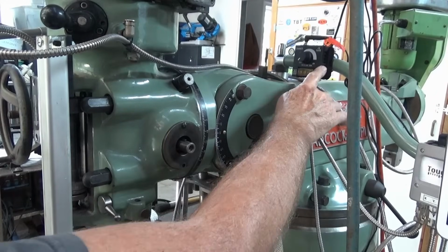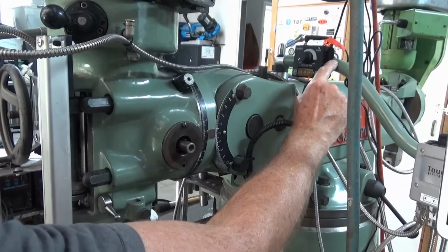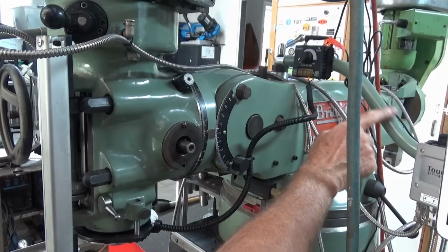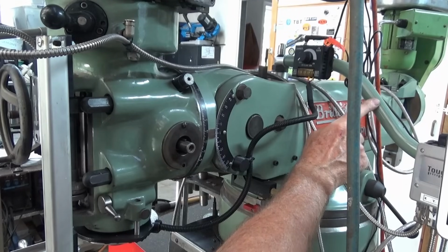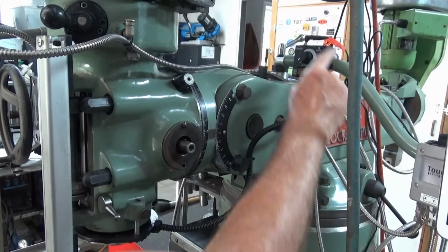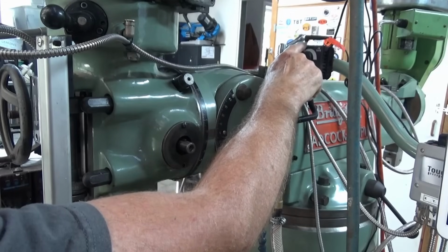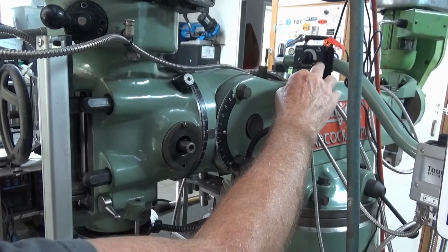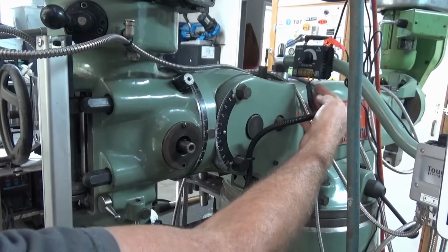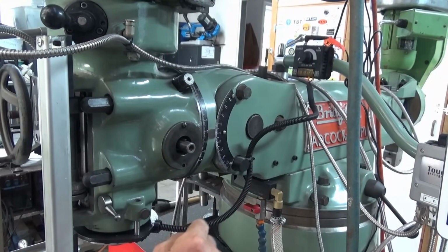So this is the dimmer here, and what I've done here is I've got a 3D printed clamp which attaches to this piece of 25mm ERW tubing, and this is the new mounting system that I use for the tablet on TouchDRO. Now at the top here is a 12 volt power supply inlet with a plug. I retrofitted that socket into the housing from the dimmer when I purchased it, and at the bottom here there's a pair of wires coming out and they supply the power to the ring light.